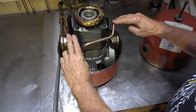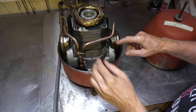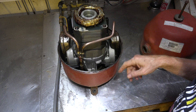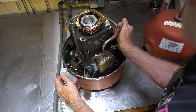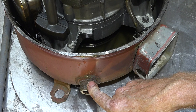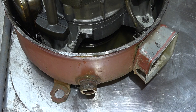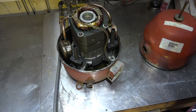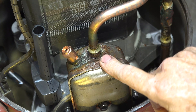Right here are the discharge lines — this is hot gas after it's gone through the compressor going in here. You can see the discharge line, and if you look closely you can see the pipe going underneath the oil. There's also an oil pump on the very bottom that pumps oil through the compressor — it's kind of an integral thing with the crankshaft.